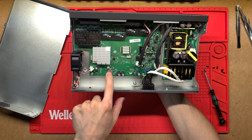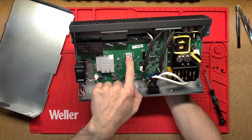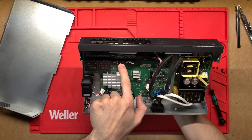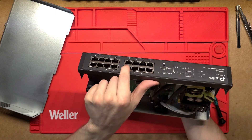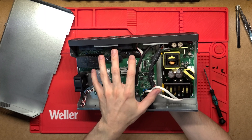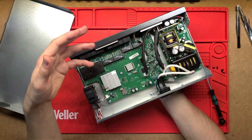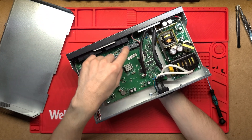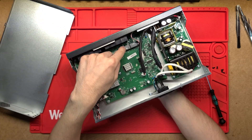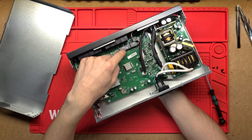This power comes into the board through a couple of small capacitors and a little inductor for extra filtering, then goes into the microprocessor underneath here. There's also another little microcontroller doing all the actual protocols - we can see all those tracks leading from it to these bigger cases, which are transformers. Each port effectively goes through a small transformer that decouples the cable signal from the board, acting as a low-pass filter. The ethernet cable, however long it is, picks up a lot of high-frequency interference, and these transformers filter that out. Any surges that come through will be decoupled, and that whole process stabilizes the signal.